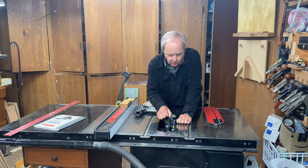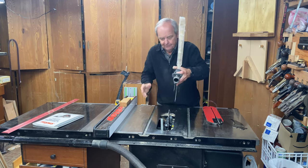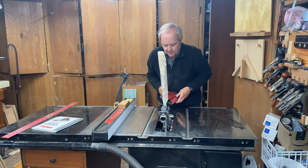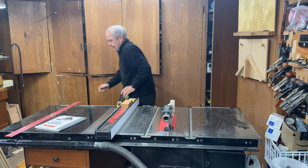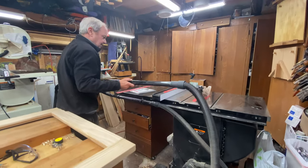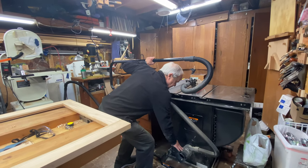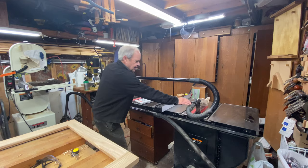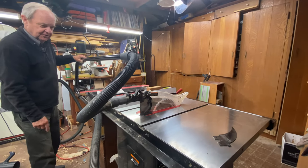The way this is used — you'll notice I have a riving knife on here. Let me take the riving knife off and instead install this vacuum accessory. I'll put my zero clearance insert back on. Then this vacuum hose connects here — I've put it down here for the video — and it sucks into a port near the exit of the dust collection system. So when I have this installed, I am now collecting dust and fibers directly from the blade through this piping into the dust collection system.